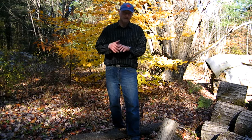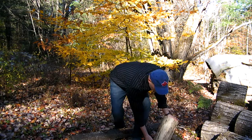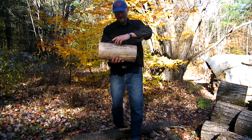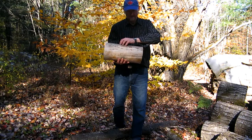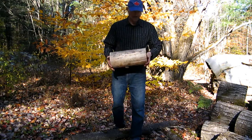I cut logs in four or eight foot lengths plus two inches, because ultimately I wanted multiples of 16 — for a 16-inch log. When I was mortaring, I would have maybe a three-inch section with no mortar, drop in some sawdust, and then mortar in and out. That gave me strength plus insulation.